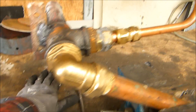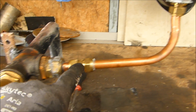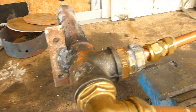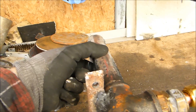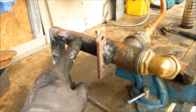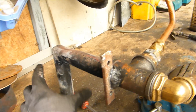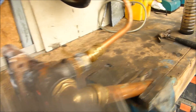If I connect up the air, it just blows out here where my hand is. This is the oil line from the back — it goes down this half-inch tube, in through this setup, around the corner, and down. The tube is inside the one-inch tube, so I have a half-inch pipe inside the one-inch tube. The one-inch gun barrel mild steel tube is just an air duct, and down the centre of that air duct I've got a half-inch copper pipe.